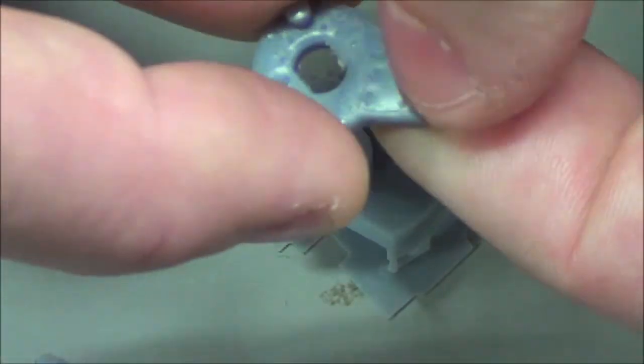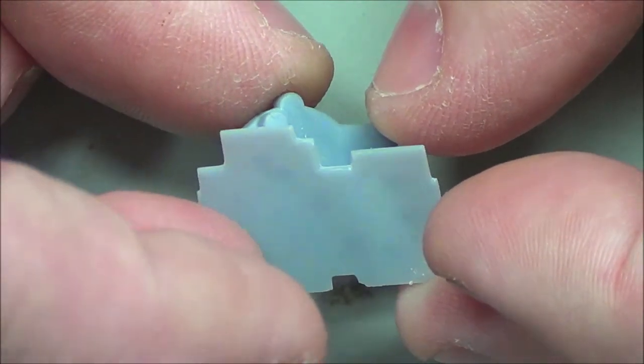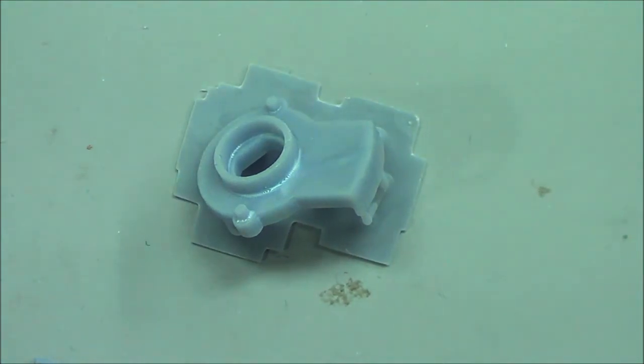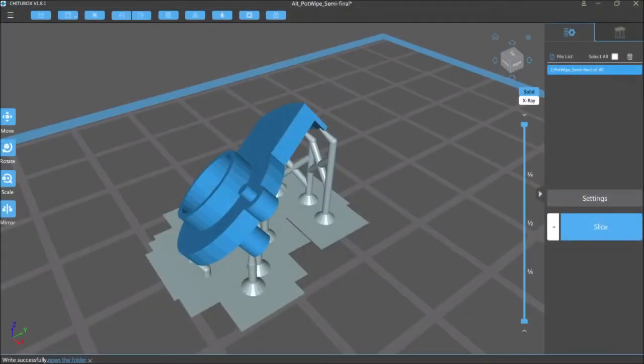It's hard, but you can see on this one that I eliminate a lot of that if I print at an angle, and I'll show you why. I'll switch over to the Chitubox application and show you how this works. Moving it in two different angles allows me, watch as I pull this lever down. This lever will show the cross sections for each layer. See how I'm only printing just a little bit per layer? There's not a whole large surface that's going to be hitting at once, except for the very bottom where the supports are.